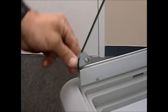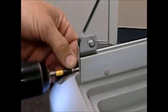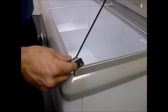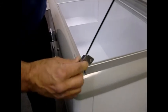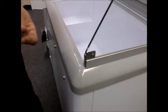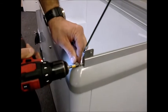The right and left back fixed brackets should then be screwed into place. Begin by putting the bracket pole into the hole of the glass located towards the back of the unit. The bracket will then need to be swiveled down to slide between the glass and the aluminum channel. This will square up and secure the side glass, but someone should still be holding the entire canopy assembly together in place.